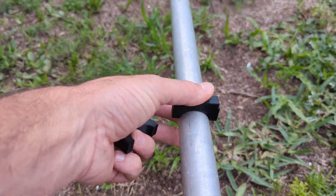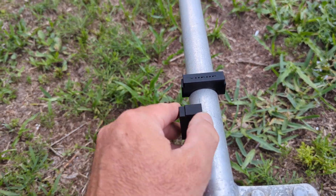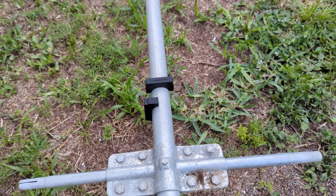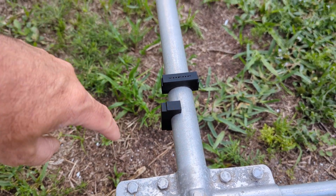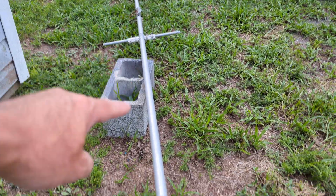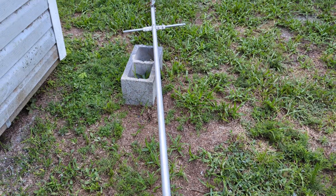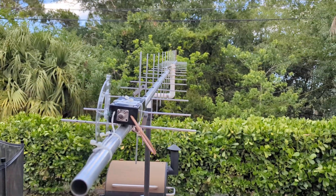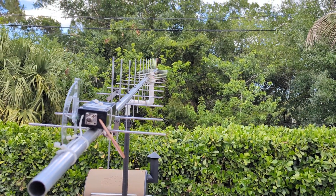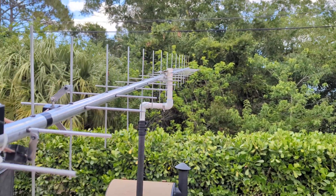As this project goes, I'm going to 3D print these and they'll stay on there permanently. I'm considering whether I want to make it circular polarized — I could do one of each, putting one element horizontal and one element vertical all the way down. But everybody online tells me 3 dB is being lost on transmit and receive because of circular polarization, and they say you're better off with a linear Yagi.